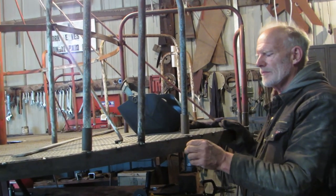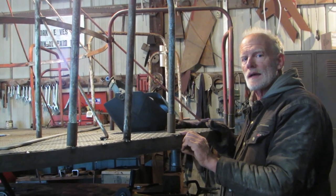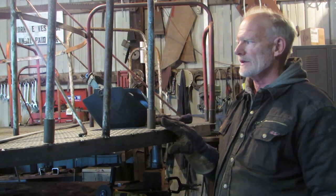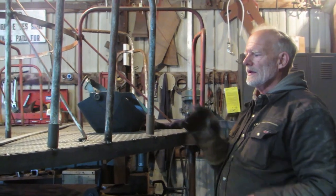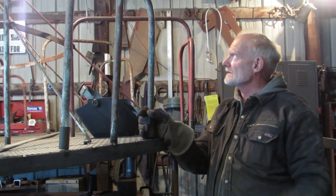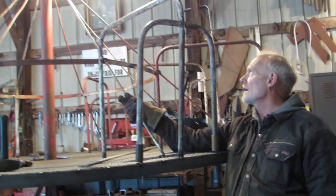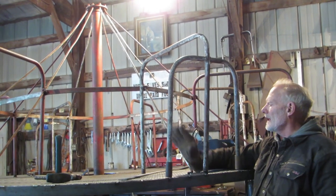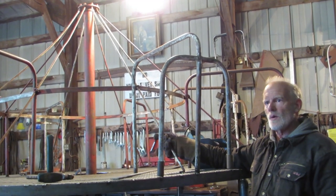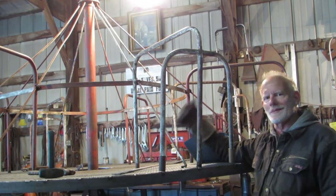Now you'll see I am putting a 2-inch by 1/8-inch flat bar all the way around it. We'll weld it and get it smoothed out so we have a nice edge. And that, then the handrails, I'll get them all level and attached. And it's an interesting design, this merry-go-round. You see these round bars, they are the strength that keeps everything in their right place. So I'll keep going on this edge and get it cleaned up, and then I'll show you the next step.